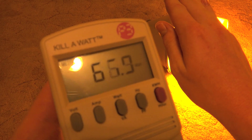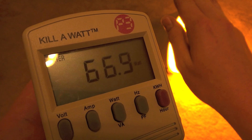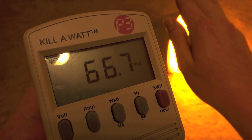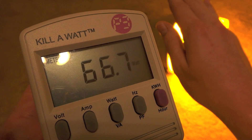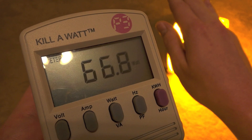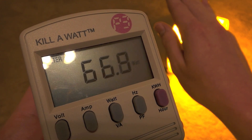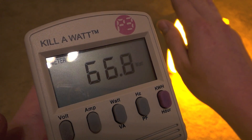I noticed after turning off the camera and letting the fixture sit for a little while, the watts started to go down really slowly. So the fixture is now at full brightness, and that's how many watts it really takes — 66.9 — and it's been hovering around this area while I've been letting the fixture just sit. So there you go, I guess that is the real watts of a 35 watt low pressure sodium fixture when it finally reaches full brightness.